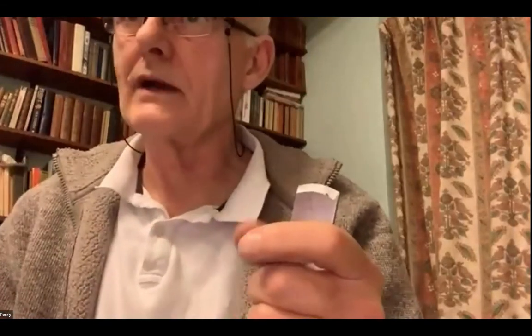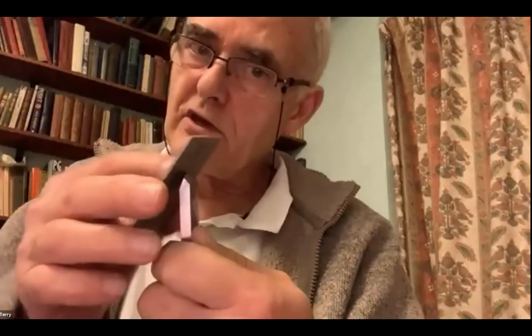Now, if you overdo it, if you press too hard, if you have the angle wrong, you'll fold over the burr. You'll create the burr and then it'll be folded and it won't cut well. So it's gentle action. Now you can do this 2 or 3 times. Having sharpened it, you use the tool, it starts to not cut so well. So you then come back and you get rid of the burr from the top,